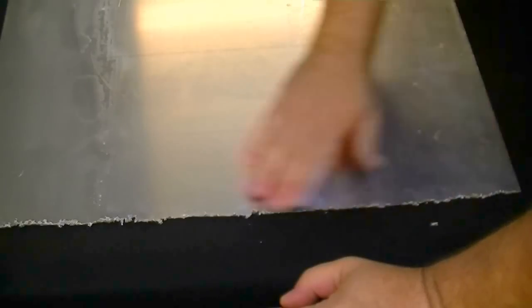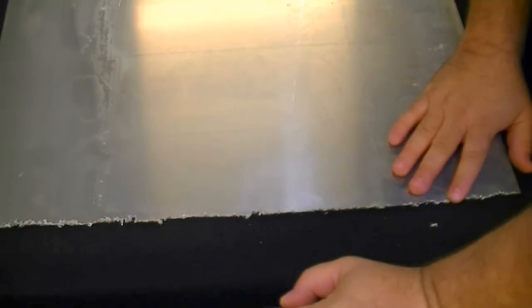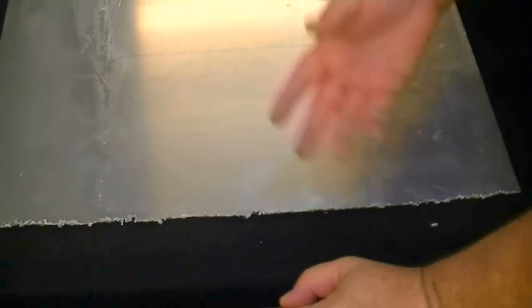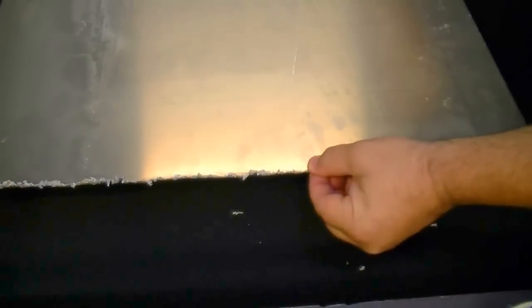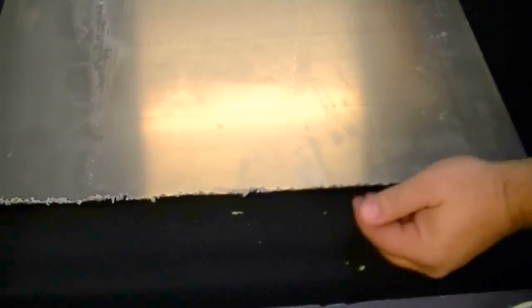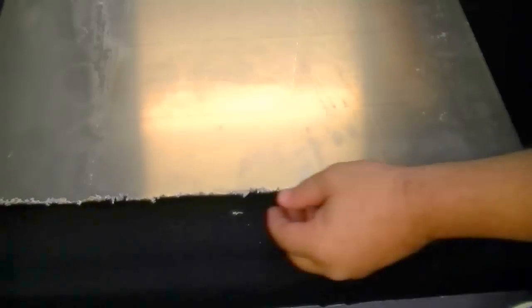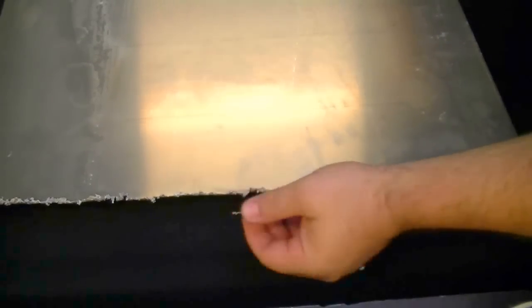But aluminum is a little bit more tricky to get out, and that way it's a lot more dangerous to handle. What we have here is a piece of metal cut by an amateur who had never really used a plasma cutter before — this is the kind of stuff you can typically expect to see. You can see the dross right here. While you're grinding or machining this stuff, it can actually fly up into your eye or even get into your hairline and migrate down later. This is the stuff that will not come out very easily — it gets pulverized or splintered into much finer particles, making it very difficult to get off your body, out of your skin, or out of your eye.